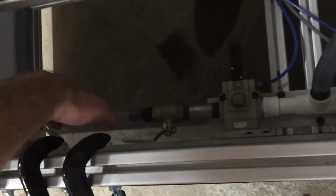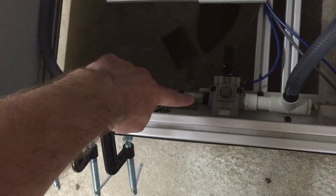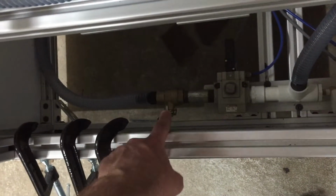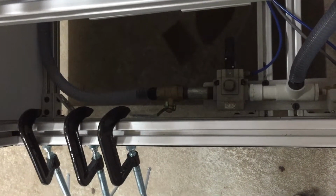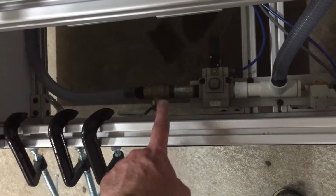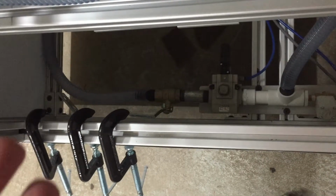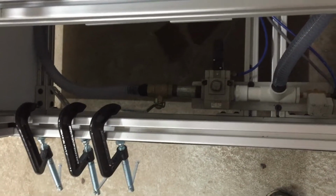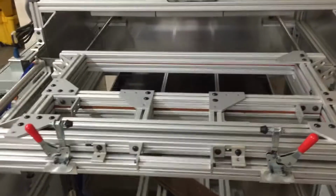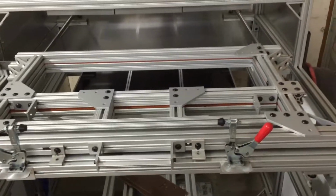Then the other big thing we showed in another video is we added a valve down in here to adjust the vacuum amount. We added in that piece of silver pipe and the valve. This is something I recommend, because if you start to bust around, you will find that having this set at different settings can change how webbing occurs, if it occurs on your part that you're forming. It can also change some of the detail movements and shifts by slowing down the vacuum, and allowing you to keep your vacuum going over a long amount of time before the pump has to take over and do your vacuum. So I recommend putting that in. It's another setting or adjustment you can make to perfect your parts. So put that in first thing before you ever even use the machine. Get one of those and put it in there. Play around with it. It's great.